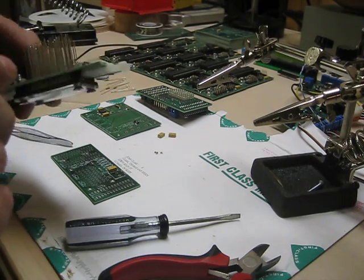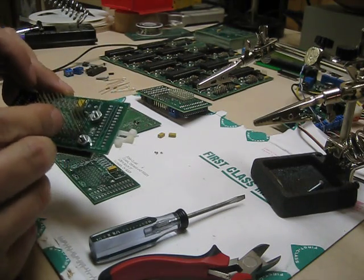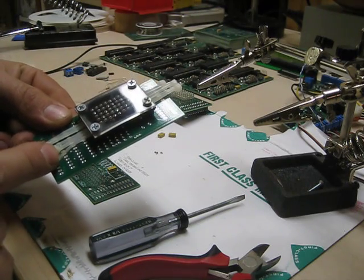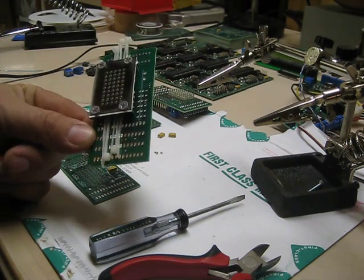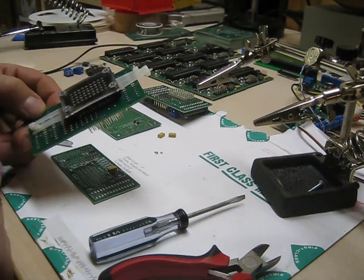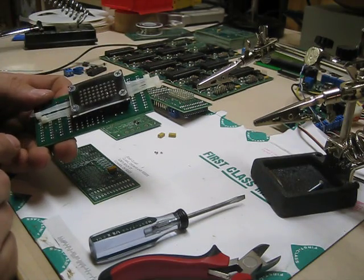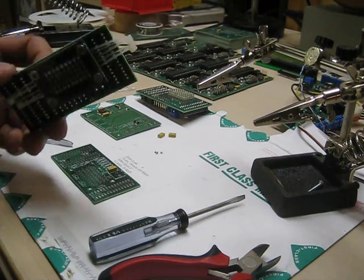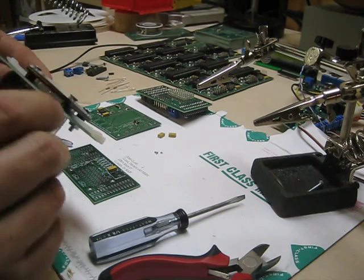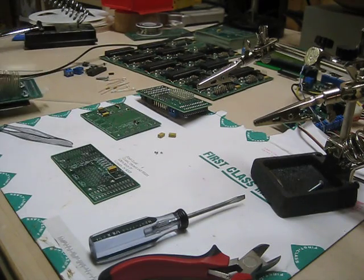Then you've got to go through and desolder it, push it back down where it belongs. And if you've clipped it too short, you're out of luck. So this zip tie method works pretty well — I go out and buy a package of these and stick one under each row. On the front logics you only need five, and on the rear logics I'll use however many rows there are. I tend to get a little bit of crowning, but not enough to worry about, and that saves a lot of problems.